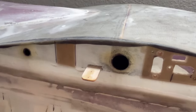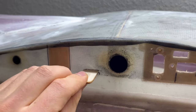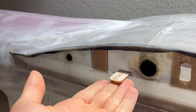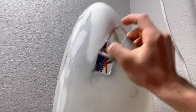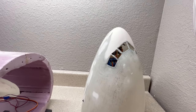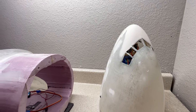For wing mounting so they don't slide off, it's basically eighth-inch ply that slots into the wing — there's another ply sheet on the wing side, and two screws keep it from sliding out. The gear strut itself is a custom strut built using aluminum rods from Home Depot, some springs, and a lot of tapping, drilling, and cutting. It was worth it because it's a very stubby gear and you couldn't get a strut for it anywhere.